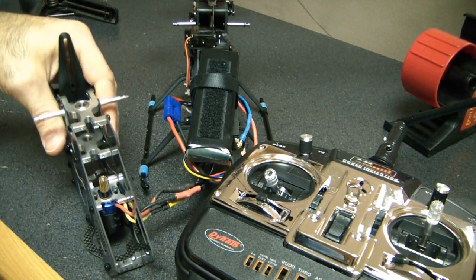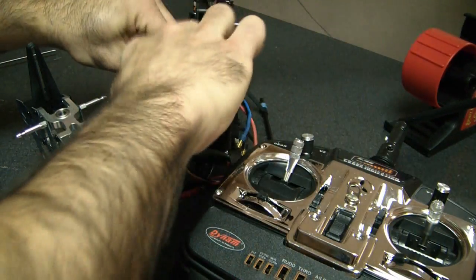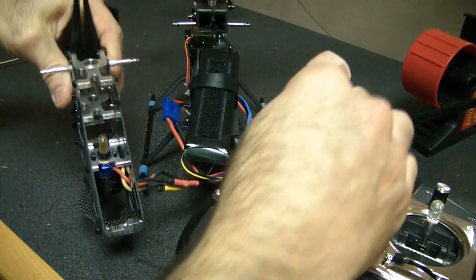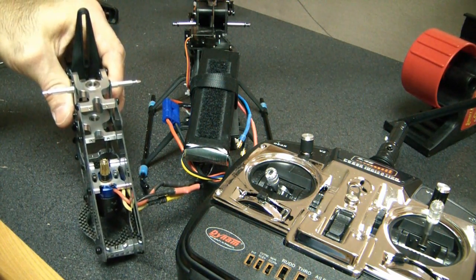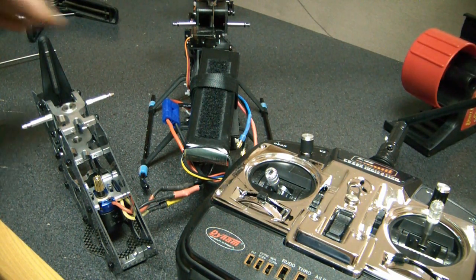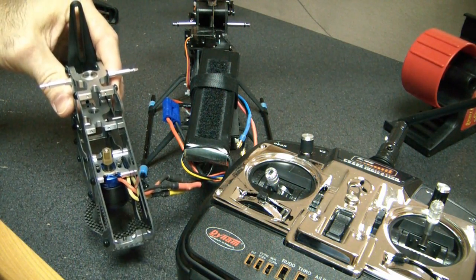I don't want brake for a helicopter. So: unplug, full throttle, plug back in, lower the throttle after the four beeps — the double beep means the brake is off. I've now set the brake. Going to full throttle and it's basically going to coast to a stop — brake is off.